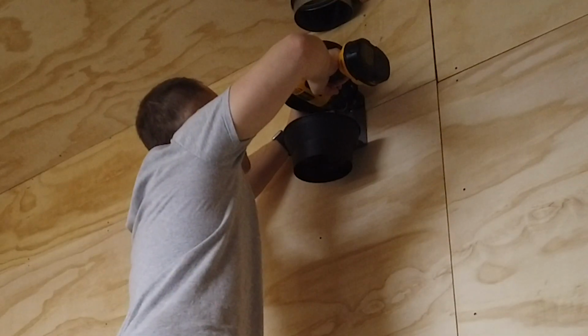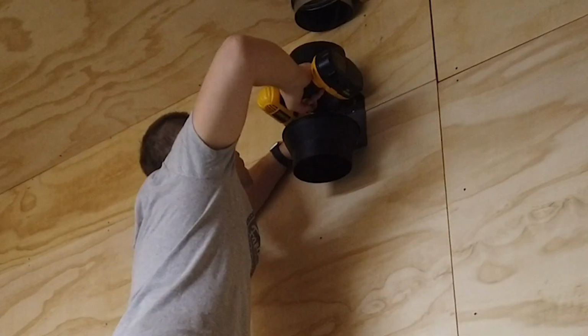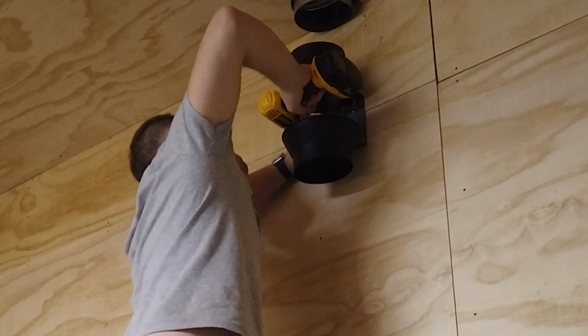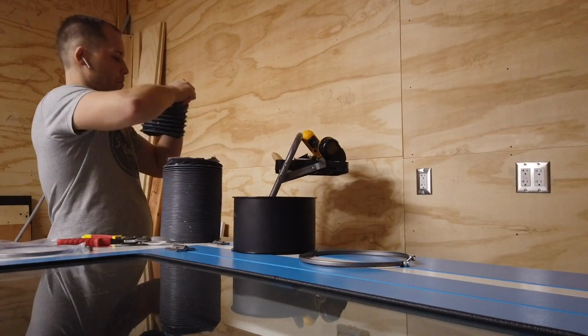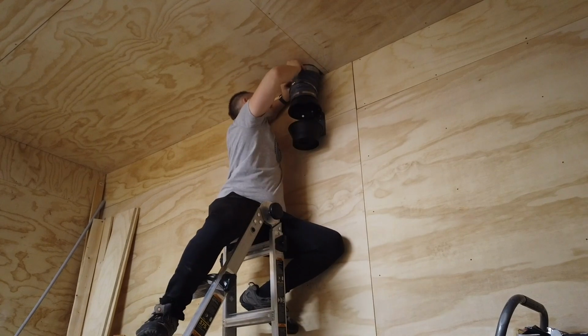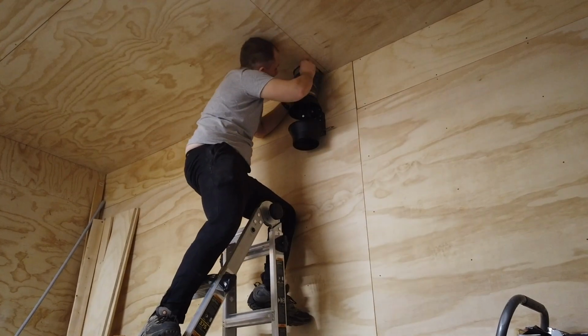To install my AC Infinity Fan, I first installed the motor housing bracket about 6 inches below my in-attic ducting using the provided screws. I then cut a short length of the flexible ducting that came with my Thunder laser to connect the exhaust fan output to the inlet of my attic ducting, which I secured with large hose clamps.